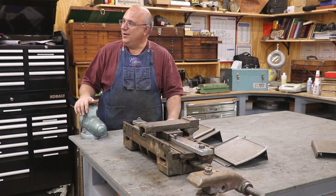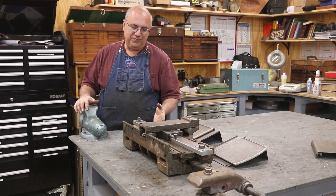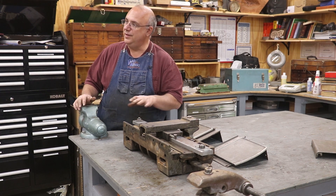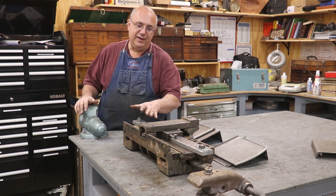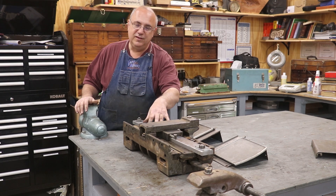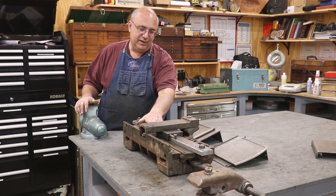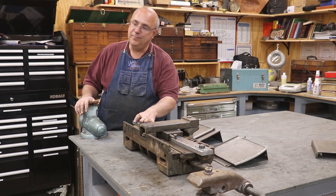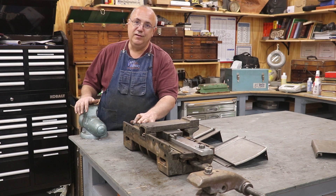When we got the compound set up and took some test cuts today, I realized I wasn't thinking things through. I needed to have the taper attachment on there to be able to make proper cuts, because the whole cross slide is not stable without this piece on there. So we're going to go ahead and get this thing torn apart, get some parts ordered. I know we're going to need some new bearings in here, and hopefully get this thing back on there pretty soon.